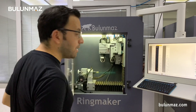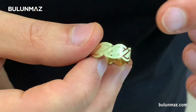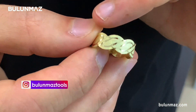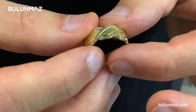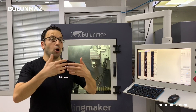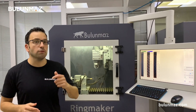RingMaker completed the operation and I'm taking out the ring. Let's see how the ring looks. I made a background first using a CNC line tool, and then I finally used a 1 mm end mill to finish the sides of my ring so it has a new shape. We saw everything about end mills in this video — we used 0.50 mm and 1 mm sizes and showed two examples. You can use end mills for enamel, making old-looking rings or bangles, making plates — anywhere, because end mills are a popular tool for CNC machines. I hope you enjoyed our video. In the next video of this series, we will see the Drillbit — another carbide tool for CNC machines. See you again soon and thank you so much for watching.